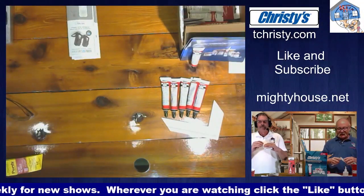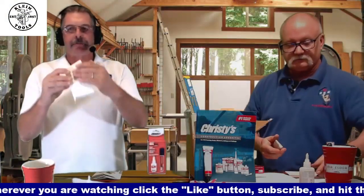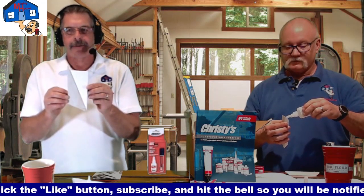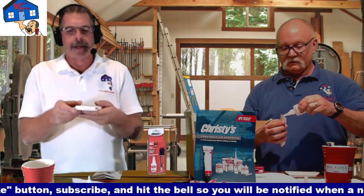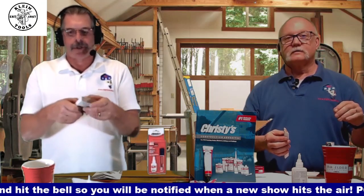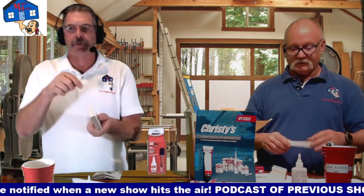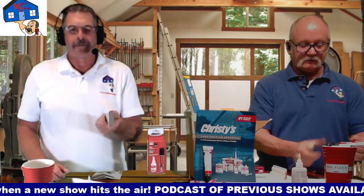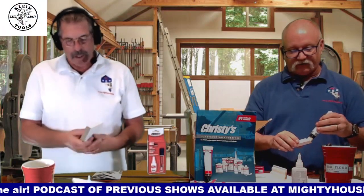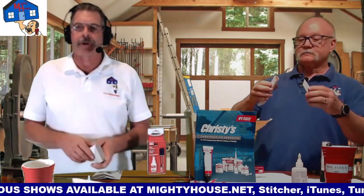I've got another one — an outside corner I want to shoot together here too. What I thought was really nice: I have a finished piece here, all painted white. One side's finished, one side's not, and there's also a difference in thickness — that piece is an eighth inch thicker than this piece. But because I was able to glue that so fast and instantly, the front is now flush. And if need be, I could add a screw or nail on the backside to make it more permanent. So if you're doing face frames, you could glue them together first and then pocket screw it — use your pocket hole cutter, do all your holes, then go ahead and glue it up with this and run your screws in.